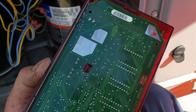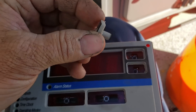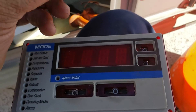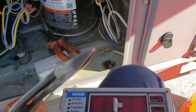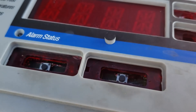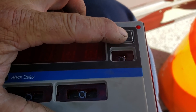Now the circuit board is snapped back into the housing. You can see where the buttons are — these little rubber pads. Of course, if I just drop these in there, the buttons are raised up, so these don't go back down in there. It's an easy fix. I just take the dykes — aka diagonal cutters — and I'm going to snip off some of the nub here. With that little piece cut off, which equals about the height of the switch, I'm left with this. Drop it in there — I'll be gluing those in there — and it just pushes the button. You can hear it click.